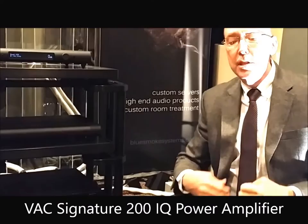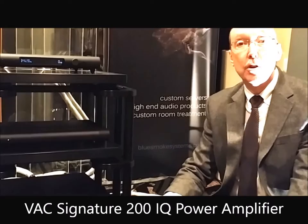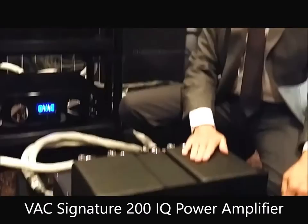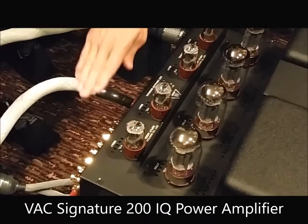That allows the balance of the amplifier to be more precise, optimizes the tube function, gives more detail, more nuance, more dynamics. Practically speaking, by virtue of taking care of those bias settings automatically, it makes the amplifier plug and play from the audiophile's point of view, and literally prevents gas current runaway of tubes from happening. The most common kind of tube failure you see, tube turns orange, the fuse blows, never happens. The cycle of thermal runaway never even gets to start with this circuit. It also will tell you when the tubes require changing. So it is a wonderful thing to live with as well as listen to. Fully balanced input capability, we ran fully balanced here at the show. And the power was delivered, of course, to the fabulous Von Schweikert VR55 speakers.